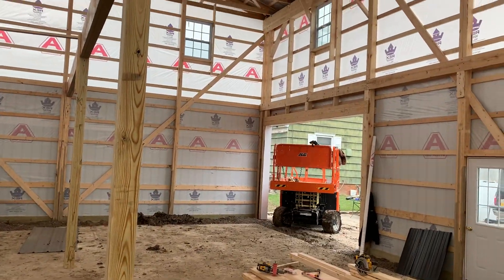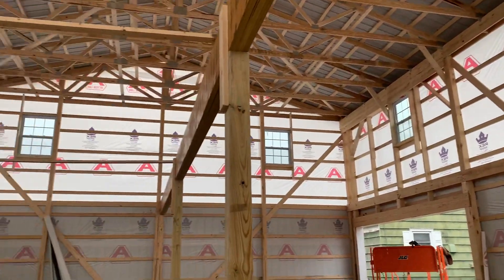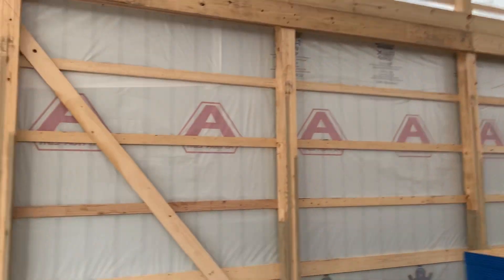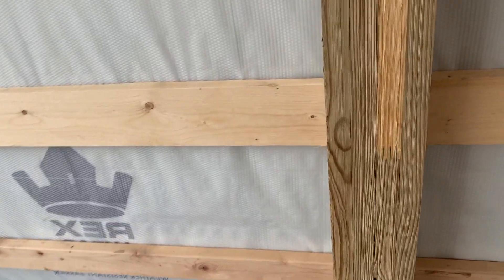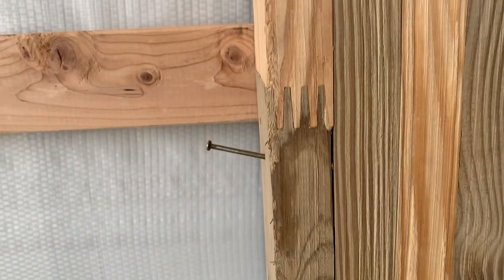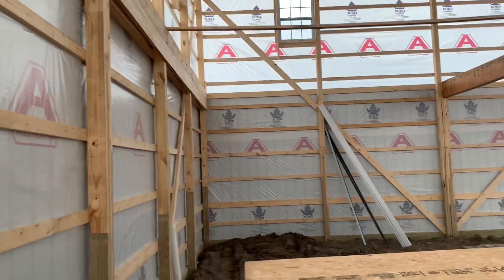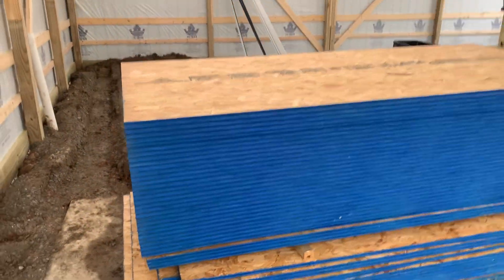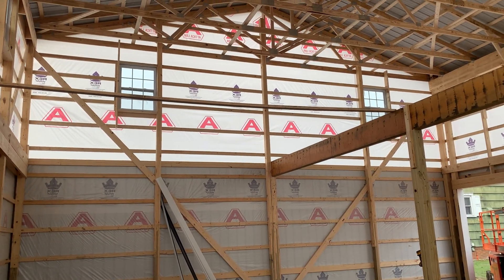A little unique, different application, but we definitely wanted to show you the four-ply. You've seen a lot of buildings with concrete perma-columns, three-plies, four by sixes, six by sixes. You can see the four-ply — two by sixes glued laminated together, run up a little higher. We're going to use three-quarter-inch tongue-and-groove subflooring. Like the video, comments are always welcome. Out of Columbia since 1925.